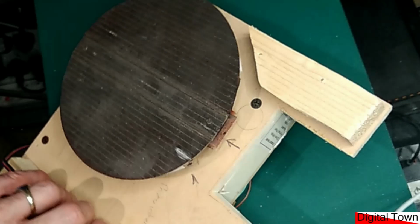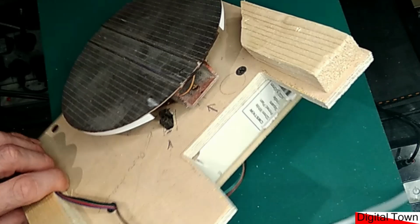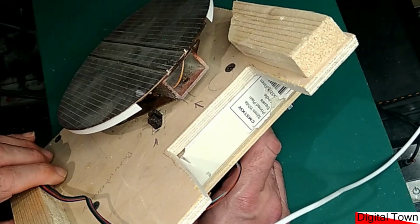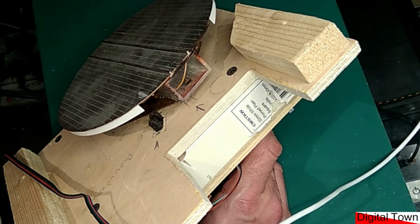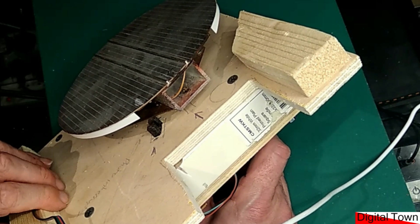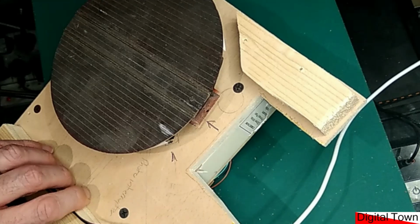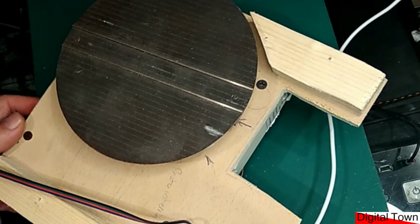Now, when I programmed this, I got all the code running nicely, and for the stepper motor to know where it actually is, it needs to index. So what I did was, when I wrote the code for this, the first thing it does is it starts up and it indexes itself. Fantastic. Works a treat. Now, I want you to have a think about this.